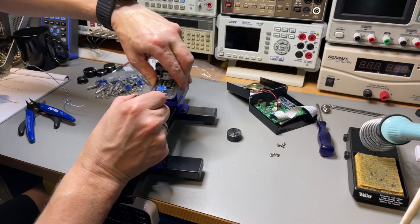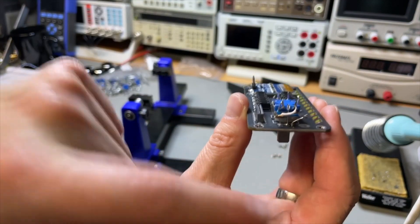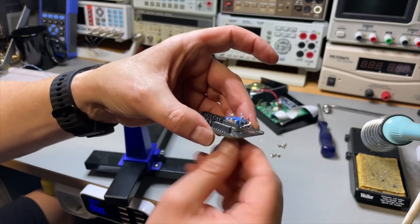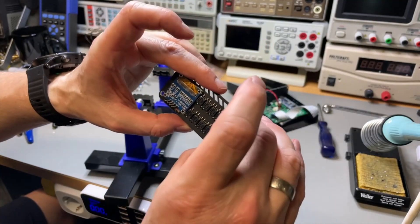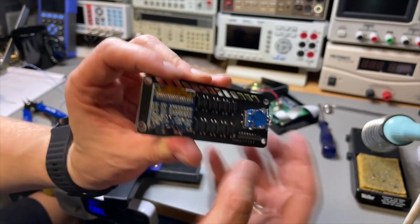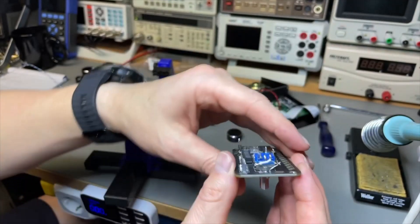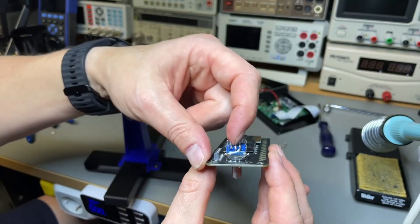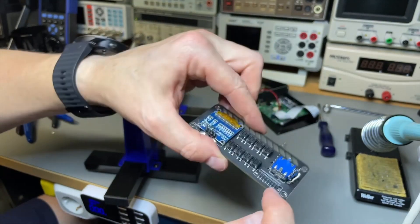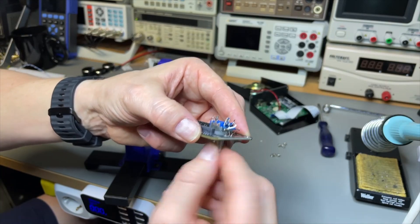Well, this is not my best work, but I managed to switch the two pins just by crossing the wires with some insulation. It seems to be stuck. I think I need to use the glue gun because this encoder is just held by the soldering itself. And because I crossed the wires here, it's not as strong anymore — it is only held now by the middle pin. So I should put some hot glue there, but it doesn't move. You don't need to put too much force on the encoder.